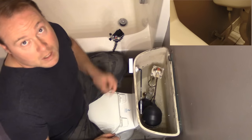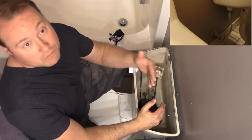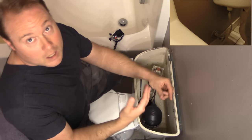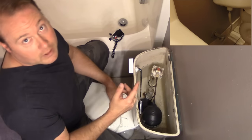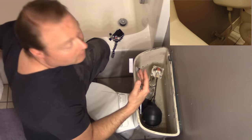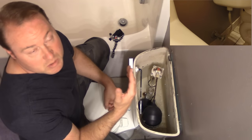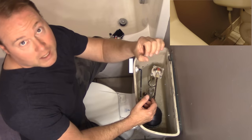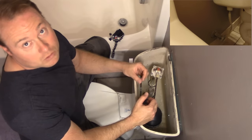The first thing to do is to shut the water off. Make sure you have a good shutoff down here. If you can't shut the water off to your toilet all the way, you're going to need to find the shutoff for the whole house, whether it's in the heater closet, underneath, or at the street. One tip: if you have plastic pipes — CPVC or PVC — you've got to be careful. I'd recommend using one hand to hold the shutoff valve and another to turn it, so you don't crank too hard and damage any of the joints.